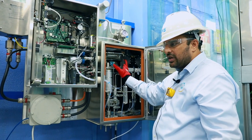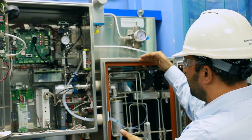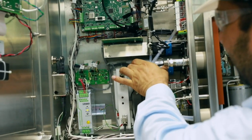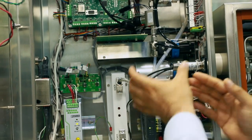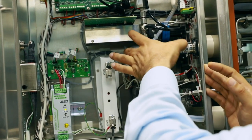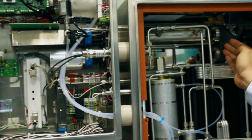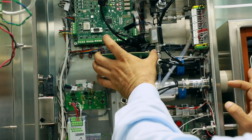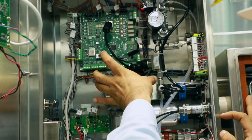All components inside are in a clean stainless steel enclosure going through the sample conditioning system. The Triple Eight analyzer uses a xenon flash lamp with a minimum life of three to five years, unlike the Model 900 where lamps changed every nine to twelve months. Units installed for over two and a half years have not had a lamp failure. The xenon flash lamp uses a wavelength of 200 to 400 nanometers. Light passes through a reflector block, through the sample cell, and back to a detector board.